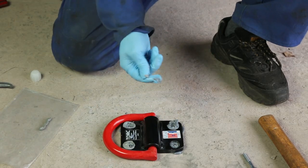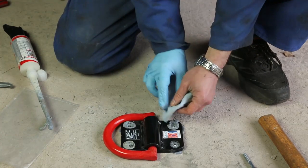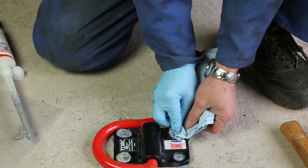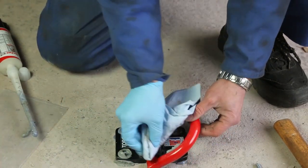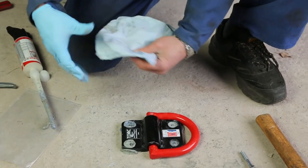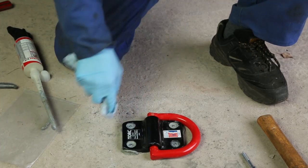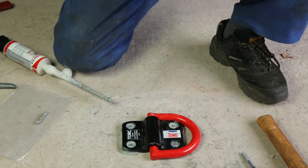Just give them all a little squidge. Gloves or a piece of cloth can be useful to wipe some of the excess resin away. With this type of kit it is a little bit harder to get an installation that looks perfect, just because you've almost certainly not got the volume of resin exactly right in every case — but this is cosmetic rather than being of any real significance. We can clean these as best we can. This resin will take something like 20 minutes upwards depending on ambient temperature to set completely, so we've got plenty of time for this process.